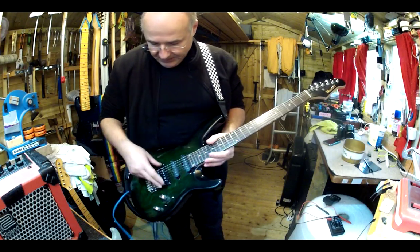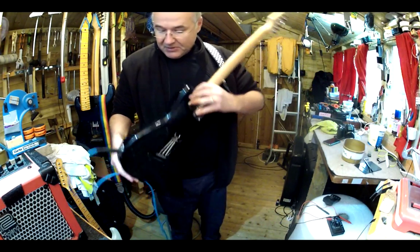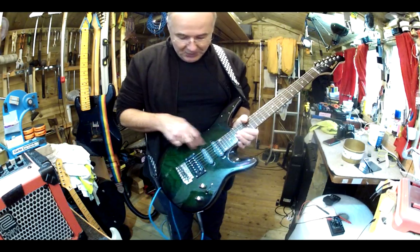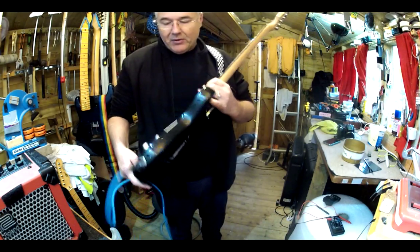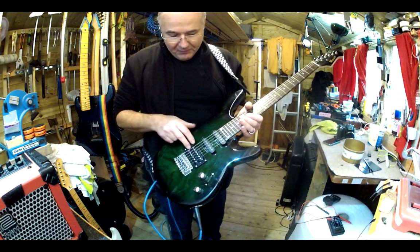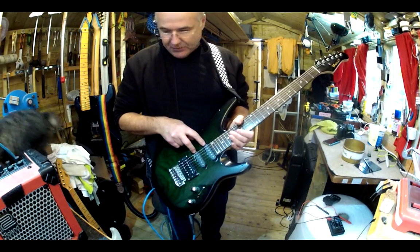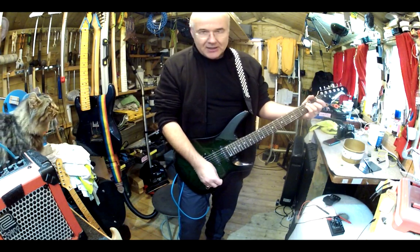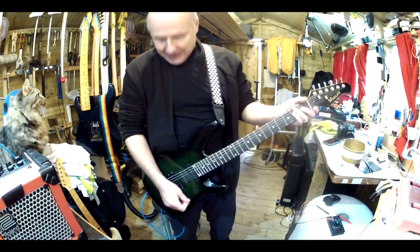This guitar came with the bridge pickup not working at all. After some tests I worked out the bridge pickup was completely dead, plus the wiring was a complete mess. I suspect the bridge humbucker died for some reason and then somebody went on a wiring spree to try and figure out why it wasn't working and rewired it badly. I ditched the bridge pickup and replaced it with an Epiphone open-faced humbucker, which is pretty powerful — chucking out about 14K resistance. It gives you a really nice range of tones, and when you kick to the bridge, this thing barks. I like the simplicity of the one tone, one volume.